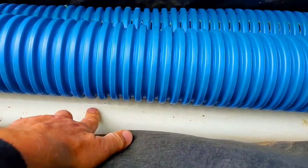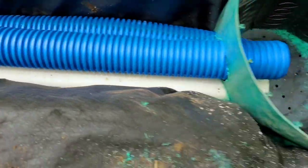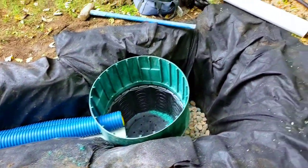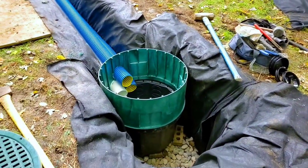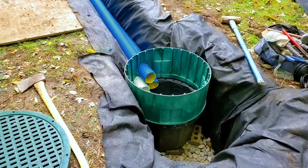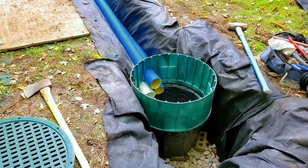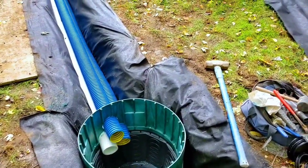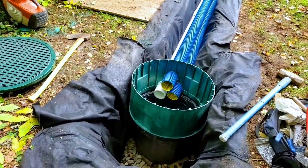We're not letting the sump pump discharge line go anywhere in the yard, because once you do that, it's a nightmare to gather up the water. So wherever you're taking this water, think about that. People always run their downspouts 10 feet away from their house. Then they let the water go. Now the water, what do you do? How do you corral that? It becomes next to impossible.